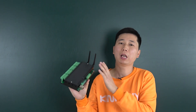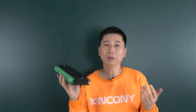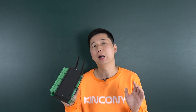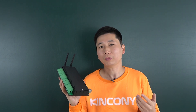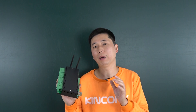The biggest innovation is that we have designed an ESP32 module into this box. We will have a development work mode for users, so the user can write Arduino code to control the relay and read the input from this H32B Pro. That will be very easy and simple, because we have designed and written the Arduino library for you. You just install the Arduino library from the Arduino software — just an online install — and you can use the library very easily.